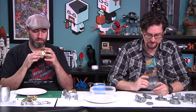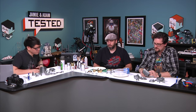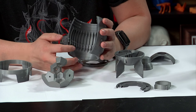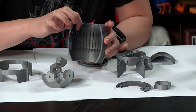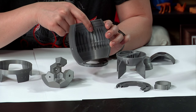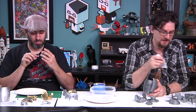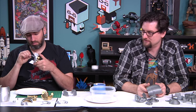This looks like a really clean print. Is there any cleanup needed? Very minimal. Sometimes, particularly with the shell on the ribs inside, when you have the printhead moving from part to part — particularly little thin ones — you might get what's called stringing, where you get a little plastic booger stuck on the side. So there might be some minor cleanup like that. You could sand it if you want. We did the ghost trap recently and I used Bondo glazing and spotting putty on the prints — it goes on really thin, dries really fast, and sands really easily. It's pretty good for filling in the lines on the print.